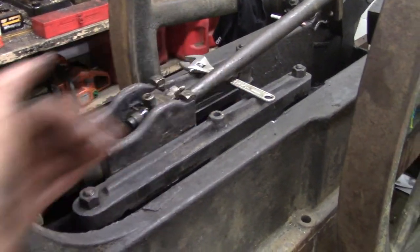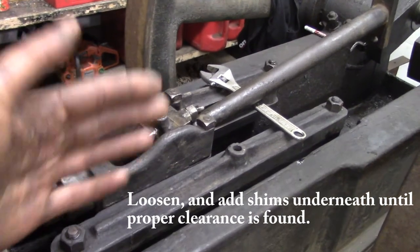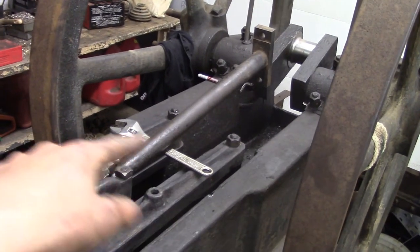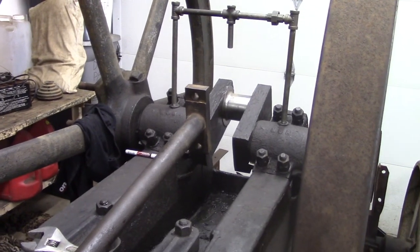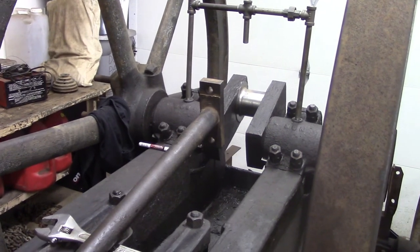Once this runs a little bit, I could easily take off the top rail and check for wear or anything like that, or loosen it if I have too hard a time moving it. I put the connecting rod on — I just have it blocked up there so it's not hitting the base. And that's it, we're ready to go. We're ready to pour the rod bearing. That's going to be a separate video, maybe a two-part video — most likely two part, just like the crosshead bearing.